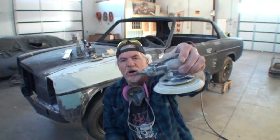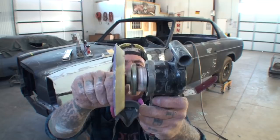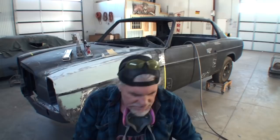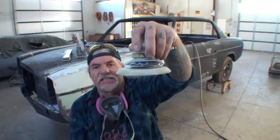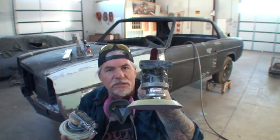Before palm hand sanders came out — the short throw — let me show you the difference. This is a finish short throw palm sander. The long throw, you can see how it throws itself — it's offset, it's a long throw. And when we take this short throw one, you can barely even feel it turn because this is a short throw finish sander. We're not talking about that today — that's not one of the most important air tools we need. But the long throw is, because it's a production tool that's going to last you years and years.